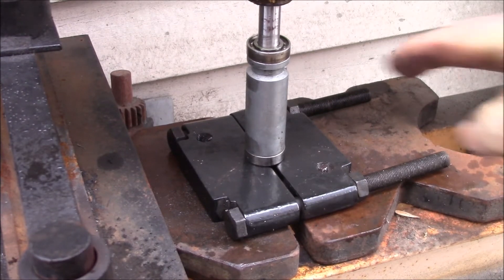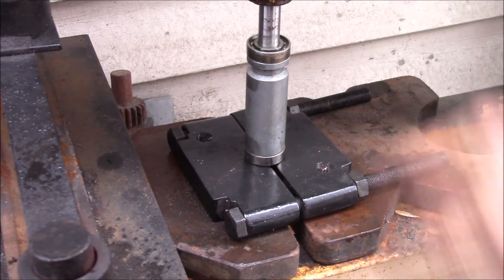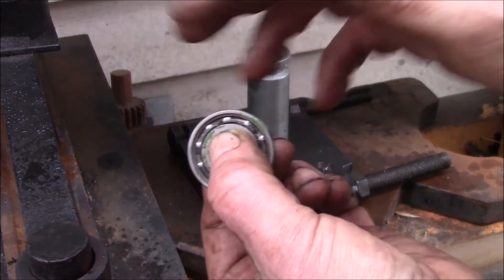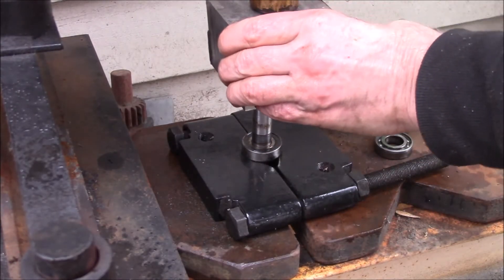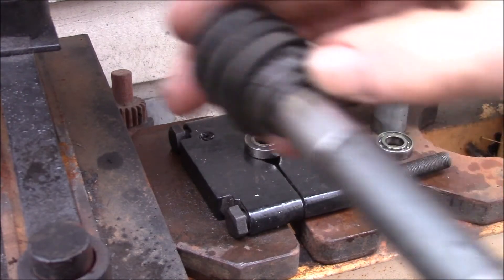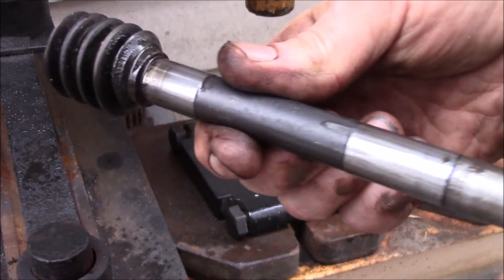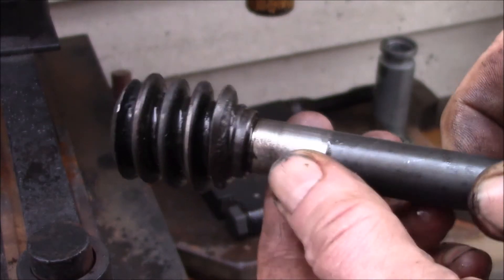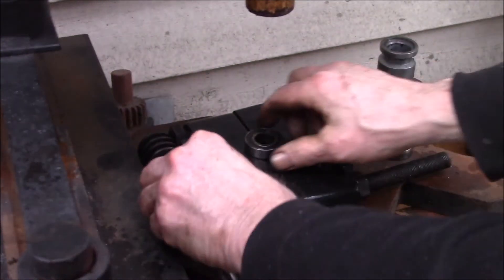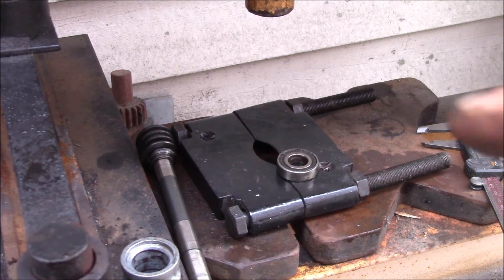I got the bearing splitter — I think I got that at Harbor Freight — using it in the 20-ton shop press, also from Harbor Freight, repairing a Harbor Freight bandsaw. There's that bearing. There is a shoulder there — that's what I was worried about. So you get the two bearing surfaces and it's turned down in the middle. You can see how it's been heat treated — the bluing. They must machine this out of one solid piece of steel and then probably induction harden the worm gear. The inner race is moving on this one — that's the bad one. I'll get those parts ordered and in the morning we can try putting this thing back together.